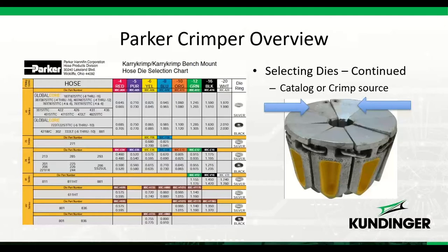On the far right side of the crimp sticker, there's a column for the die ring — a metal ring that sits on top of the die and helps set the depth. There are two options: silver and black. You need to pay attention to which die ring you're using because it will set your crimp specification. You'll sometimes use silver and sometimes black depending on what you're crimping.